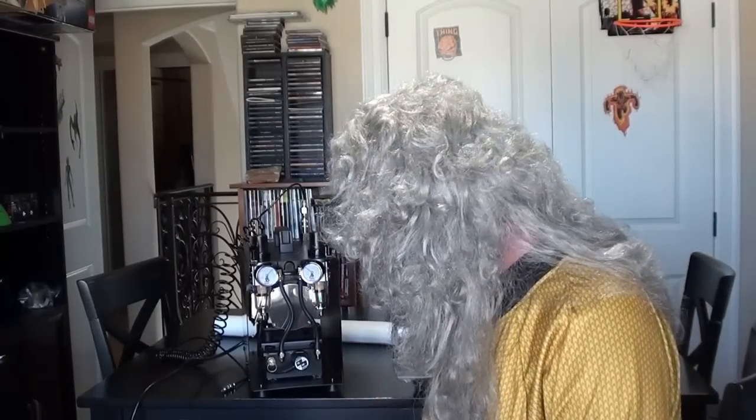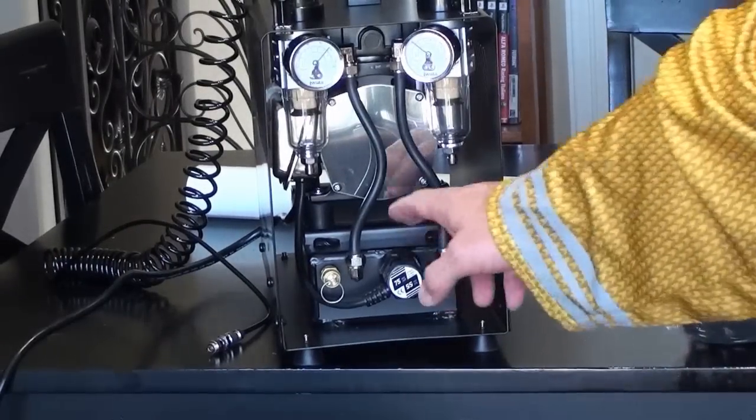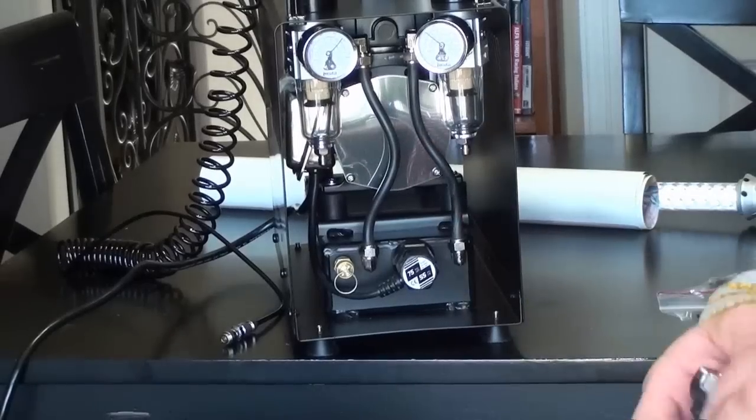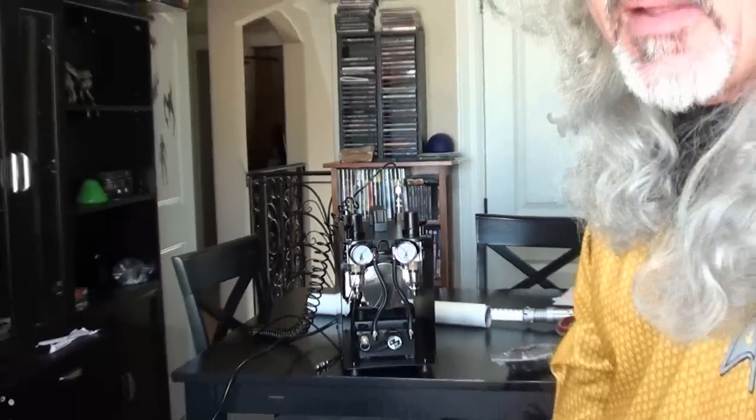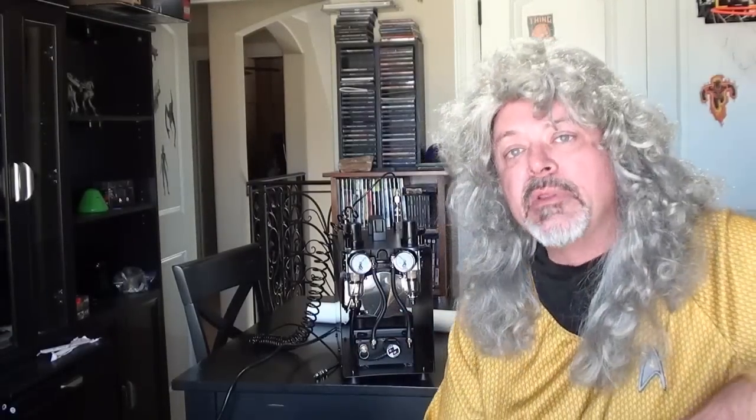What I found really strange is it has a square tank — every compressor I've ever seen has a round tank. It's got some real heavy welds on that square tank. From my civil and structural engineering days, I know that's not easy to design for: the tank will have much thicker walls than a round, cylindrical, or spherical tank would. Those shapes distribute pressure more evenly. A square tank has more pressure on the corners than the edges, so they have to build a really beefy tank. But the square shape does cut the size of this thing down.